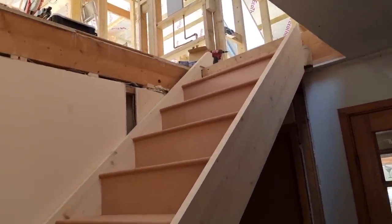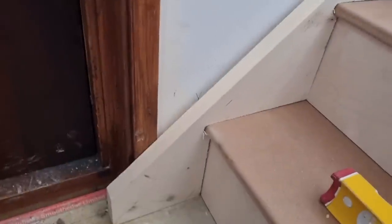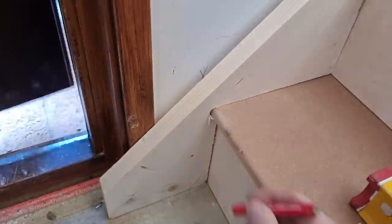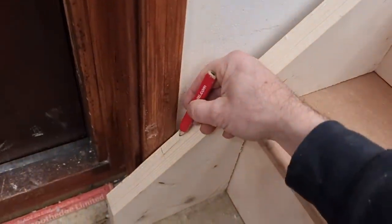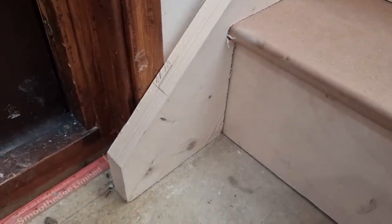So we've hooked it in, we're going to whip it all out, get it all glued and scribed and fixed back in, fixed back to the wall, and then that's pretty much the staircase sorted. I'm also going to be reducing the length of this wall string to sit somewhere in the middle of this architrave. And what I'll also be doing is housing round that architrave here, forming a rebate. The reason I'm doing that is because I want the stairs to move back as close against the existing wall as possible. And I can travel around about 12 millimeters there. So I shall let this out by 12 millimeters there. So I shall take out this just here, all the way through, and that will take that back as well and cut this off there so the string is not coming past that existing door opening.